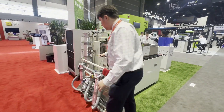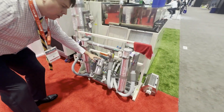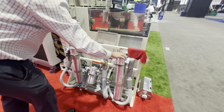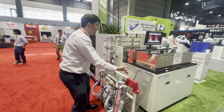Going into a bit more detail, this all goes through a series of filters. We have the strainer — this is typically where most of the burrs end up. We have a 20-micron filter here and then an activated charcoal filter as well. This is what we use for water-based deburring.